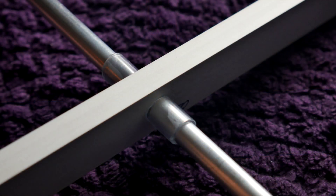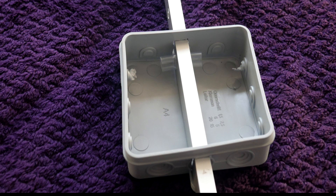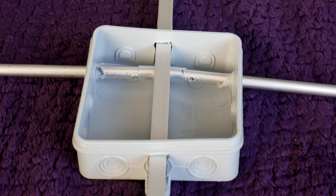I secure the elements by sliding them through the hole and then sliding vinyl tubing over the elements — 10 mm vinyl tubing over the 8 mm pipe. This is the hardware I'll need to connect the coax to the radiating element; I'll need to drill holes for the bolts through the pipe. Unlike the other elements, the hole for the radiating element is big enough for the tubing to pass through completely. The radiating elements pass through the box and enter the tube for stability, but the two parts of the radiating element do not touch each other.